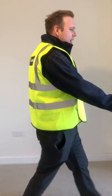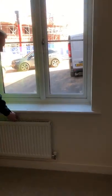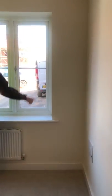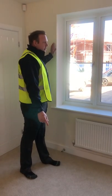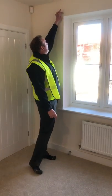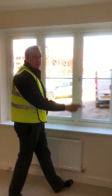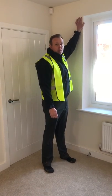If we just come around to this radiator here — any radiator underneath the windowsill has got to go up to the ceiling as well. As you can see, this one has actually got to work its way around the window. So on either side of this window reveal, there'll be a water pipe going up to the ceiling. You must check in this location and this location before you start putting screws into the wall, to make sure you're not going to go through the pipe.